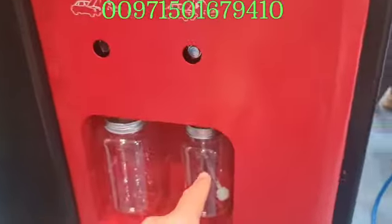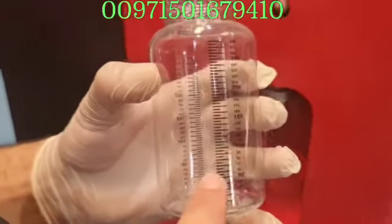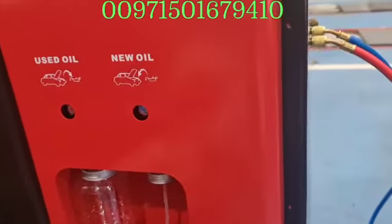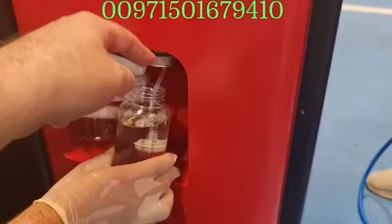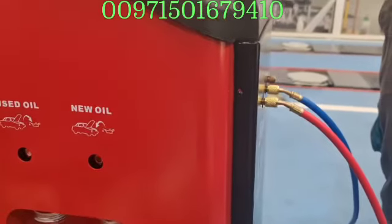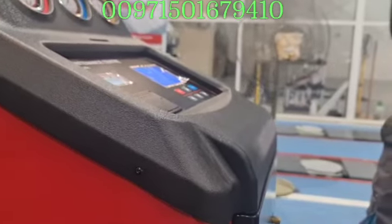Please add oil in here. Old machines ask you to add only 0.1 or 0.2 liters, but this machine is clever enough to absorb how much it needs regardless of how much you are filling. Please fill it higher — it will not absorb more than needed. This machine is smart enough: if there is no oil inside, it will tell you 'I cannot work, there is no oil inside.' The machine is also clever for direction — if you don't know from where you are filling or recovering, it will program itself and help you and absorb the gas from the right direction.